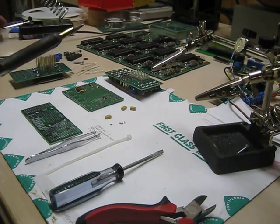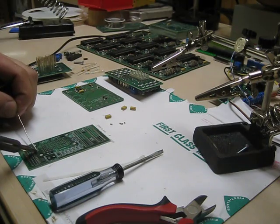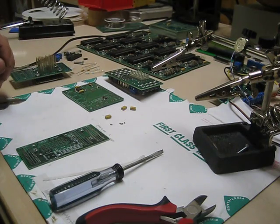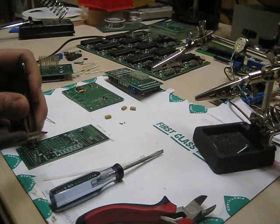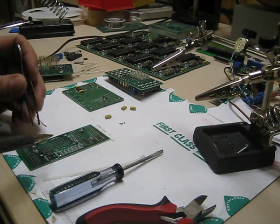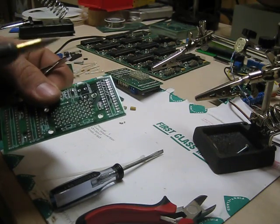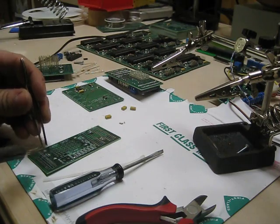With my soldering iron heated up, you put solder on just one of the two pads, and I'll usually go through and do all of them. Especially on the rear logic, there's a whole bunch of little pads. Then with your tweezers you can pick your little components up, hold them in place, and solder them. I've got that one little capacitor on there but it's only soldered on one side, so I can use my tweezers to hold it in place while I heat the solder up and get it positioned exactly where I need it to be.